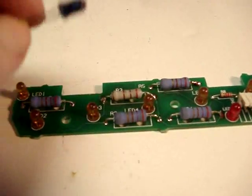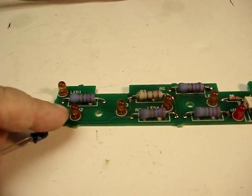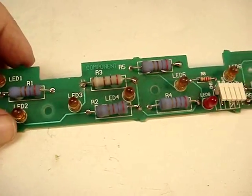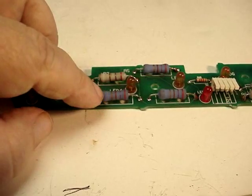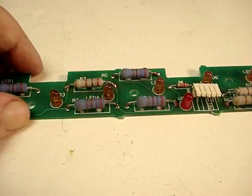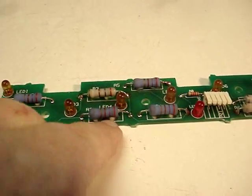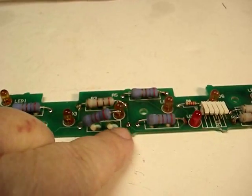We're here at the soldering station. I have an infrared LED ready to replace this one if it turns out to be bad, but further inspection of the board revealed the LED is probably good. It's commonly known on these pinball machines that this board has problems with the resistor leads breaking from the vibration of the up-kicker solenoid. I followed the trace on the board and sure enough — the resistor lead had broken. It didn't come unsoldered; the lead itself broke.